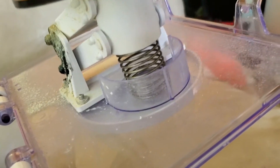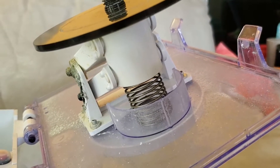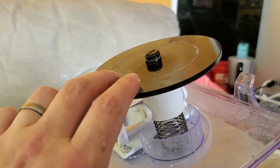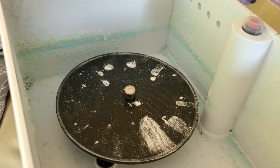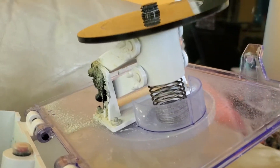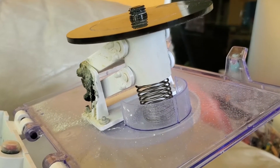This thing here is made out of some kind of plastic that tends to crack. The reason why it's so complex is that it needs to be able to compress so that when you close the lid, it makes tight contact with whatever the resurfacing material is there. So it can't just be a simple mechanism that holds the disk — it's got to have that spring, and it's got to have those arms that can make it move in just the right way.